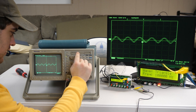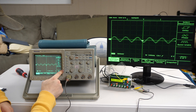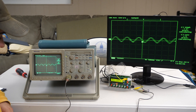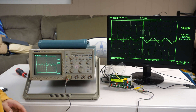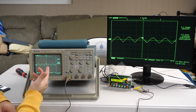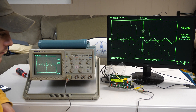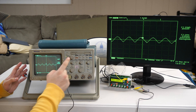It's reading it from — let's actually see — measure. As you can see, it has all these different functions. The voltage high is 260 millivolts and the voltage low is negative 240 millivolts. The good part about this is that it's reading a positive and negative absolute value, which means it's actually reading the signal generator correctly. If the high was 500 millivolts with a negative 240 millivolts low, it means the total positive and negative are out of range. The range is set to 260 millivolts, so having it within that range is really good.